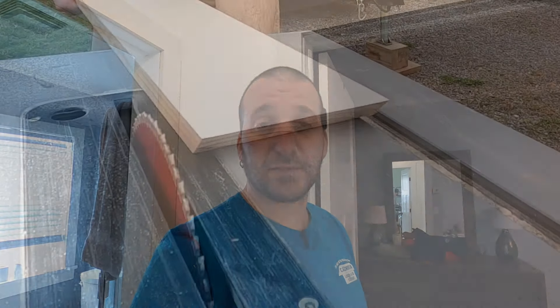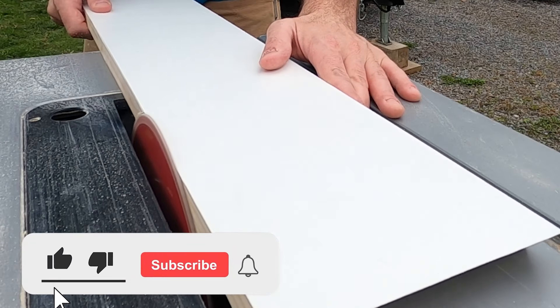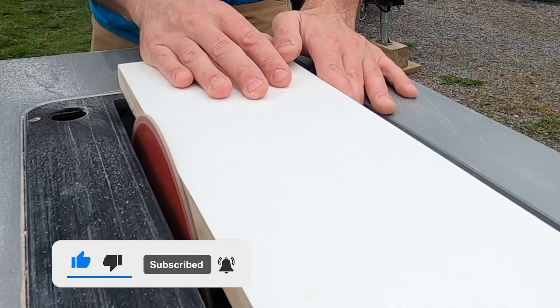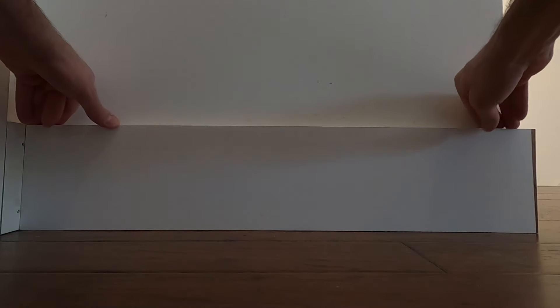As far as cutting the actual wood, if you're not comfortable doing what I was doing on the table saw — basically guiding it with my left hand and pushing it through with my right hand and easing on and off — you can use a hand plane or an electric hand plane, which does the exact same thing. Okay, so I'm really happy with that. It's not wobbling anymore. It's touching the whole way. It's good to go.